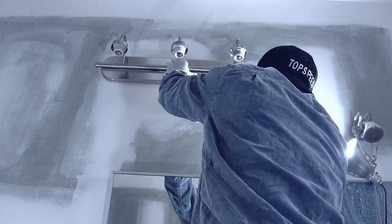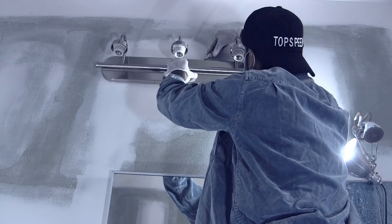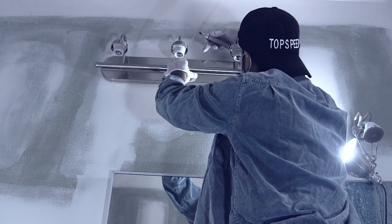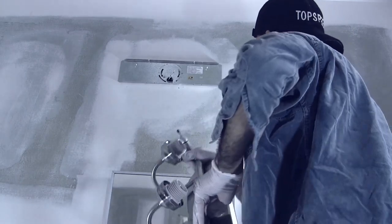To do this, all you've got to do is attach the fixture to the mounting bracket, move it where you need to, take a marker, put it into the holes of the light fixture, and that will mark off on the mounting bracket where to drill new holes.